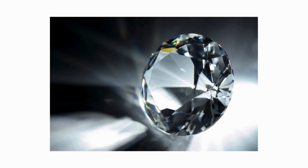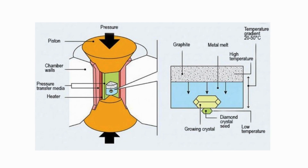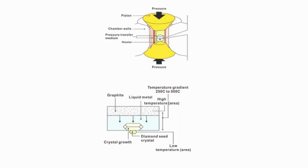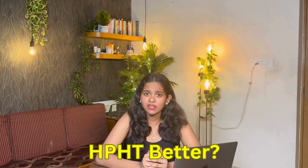After three to four weeks, the diamond crystals grow out in their natural raw format, after which they are cut and polished for setting onto diamond jewelry. In summary: a small seed crystal is placed in the growth chamber, filled with carbon-containing gas, heated to high temperature, and the carbon precipitates onto the seed. The stones are taken out every few days to remove non-carbon particles, then put back — with this start-and-stop cycle repeating throughout the entire growth period.